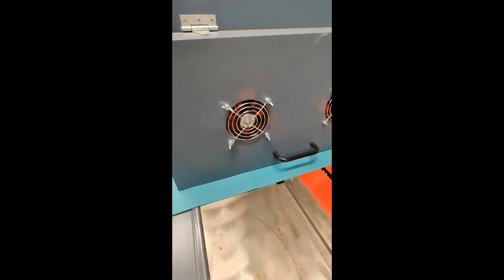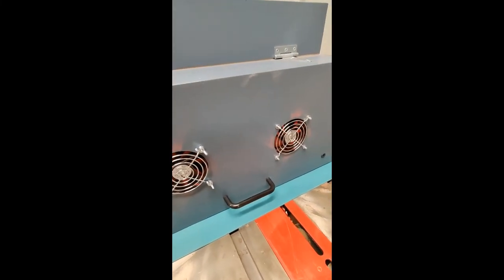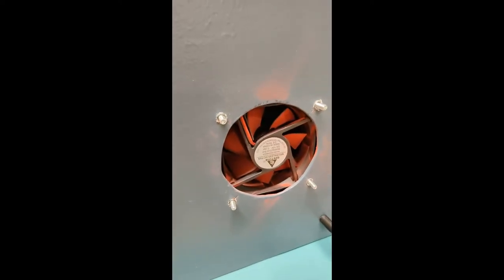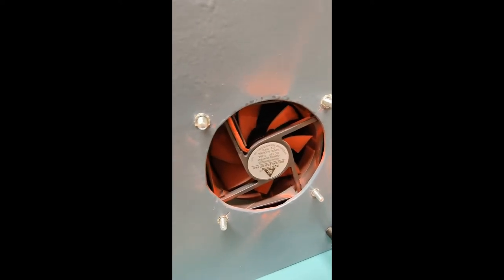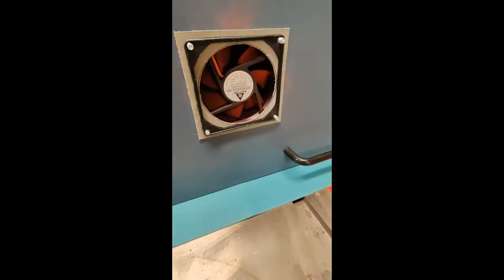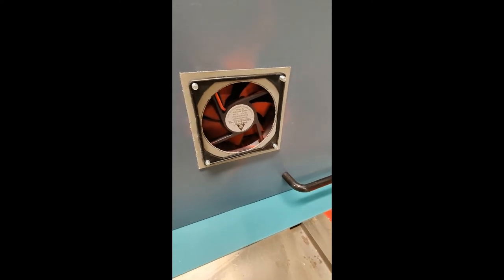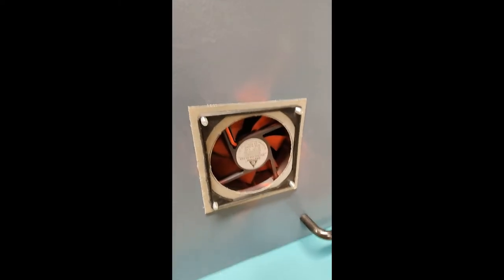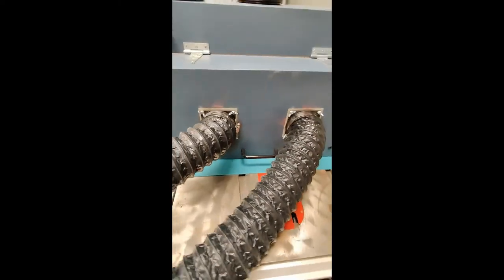Here's an addendum to the spray booth. When I first built this spray booth, I thought I would just put finger protectors on the outside and vent into the garage area where I was painting. I quickly realized that I'm going to have to do something else instead. So I changed the mounting for the fans and put these wood inserts in with some screws that would protrude. With that, I'm going to be able to mount my vent hoods. I ordered a silicone fan gasket to fit the fan brackets that I have, and I also fabricated a paper gasket to further seal around the edges because I noticed I was getting some venting around the edges, as you can see when I was painting with some red paint. I used wing nuts to attach the shroud with the gasket, and now both fans are connected and vented.